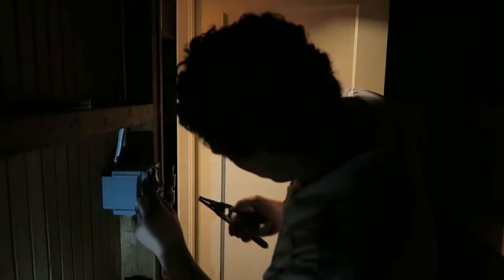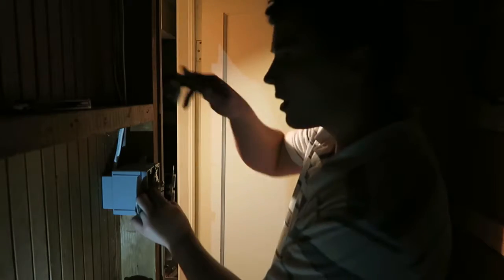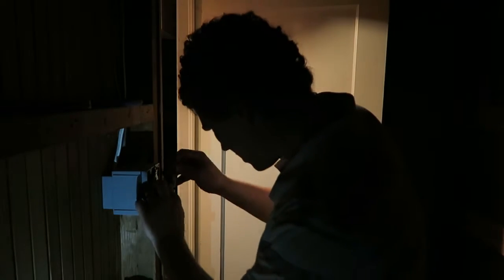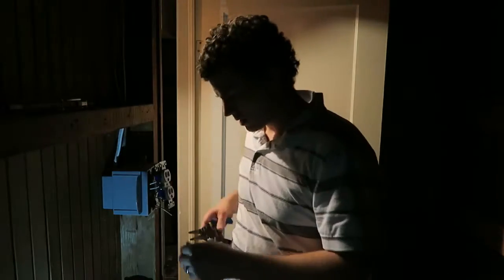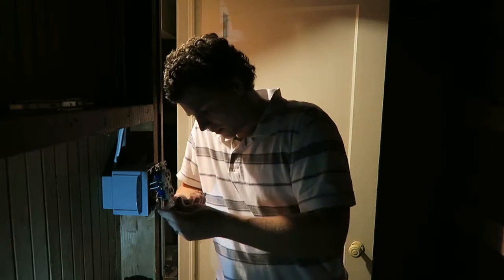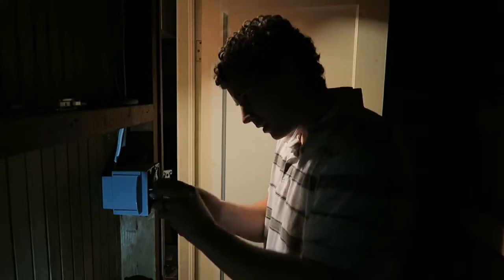And then when I wrap it around the screws, I strip it a little bit longer, closer to an inch, wrap it around, and then that allows me to get a nice, good full contact around that pin. And then use your pliers to fully seat that. Pretty snazzy, pretty quick, pretty easy. I don't know why I don't really trust the push connectors, but I generally will use the screw, even though it's a little bit more work.